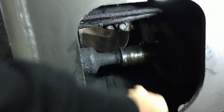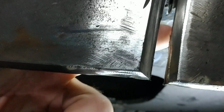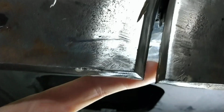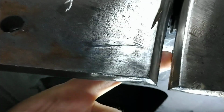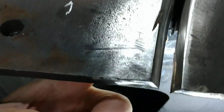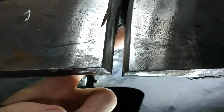What do you think of that vertical up? That one was a hardwire one. Here you can see the backer bar on the other side that I used. So that's where I'm at. I got it cut wide open, and if you can walk across it, you can weld it. That's what they used to tell me. Right now I'm at a 1/4 inch, but I'm just going to do full pen, because I can walk across that like walking the cup with TIG welding. I can do that with the hardwire, like .035. I'll put a root in there.